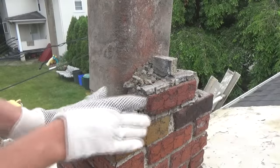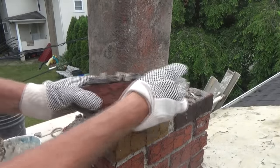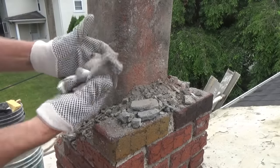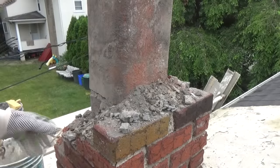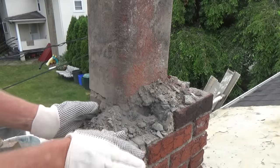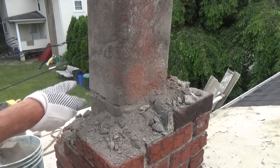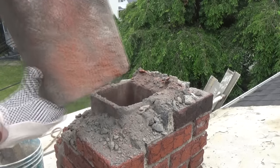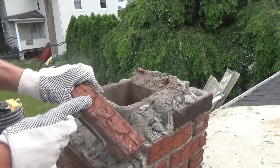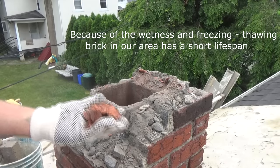I'm going to talk to you a little bit over the noise — it seems like every time they film, the noise comes. This chimney, actually the mortar held up pretty good. Maybe they added a little cement to it. What really killed it at the beginning was that TV antenna — it's like hitting it with a hammer all the time. So we're down to the flue; flues just hold on like that. We're taking everything off. All these bricks, they disintegrate — see how they disintegrate?